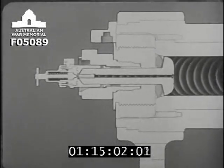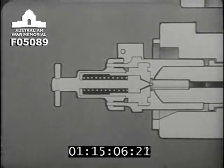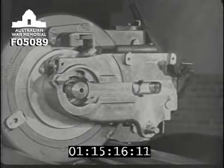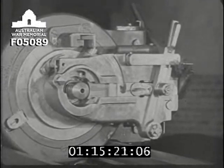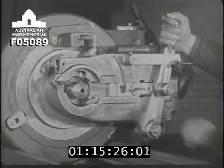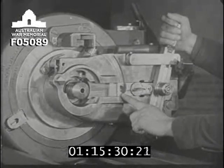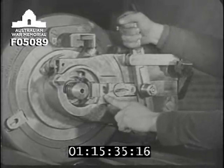The firing mechanism not only holds the tube in position, but enables us to fire it and hence ignite the charge. Now let's find out how it fits onto the breech mechanism. Here is the breech mechanism without its firing mechanism. Before we fit the firing mechanism in position, we must first put on these parts: the lock actuating lever, link, and slide. Moving the lever from right to left also moves the lock actuating link and slide. Watch the movement of this slot as the hand lever is moved. You will hear more about the slot in a moment.